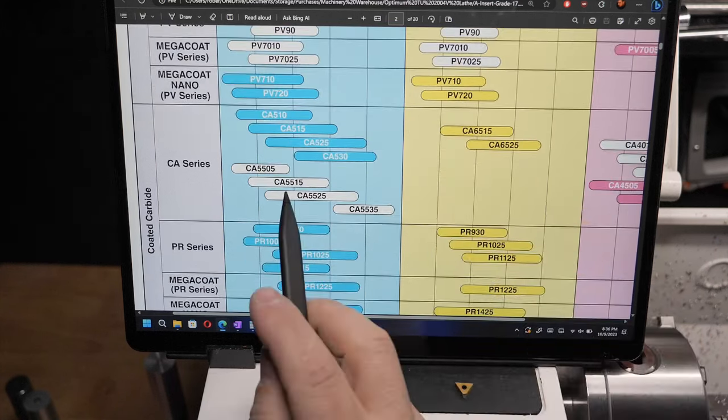I notice on screen it's not easy to tell the difference between all of these because, quite frankly, these are all within 20% of each other. See, if I called that 100%, I'd call that 80%, 90%. So they're not that different. So the interesting thing there is that the aluminium, I get almost the same result no matter what tool I use. And with the steel, I do get noticeably different results. And in particular, that steel one there, you can see it is better.